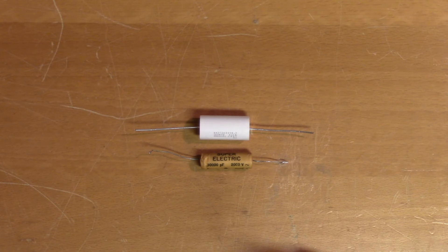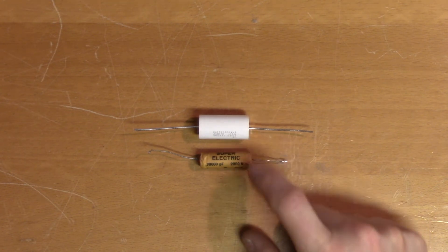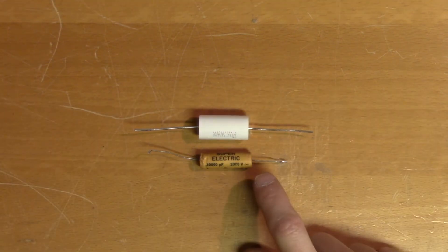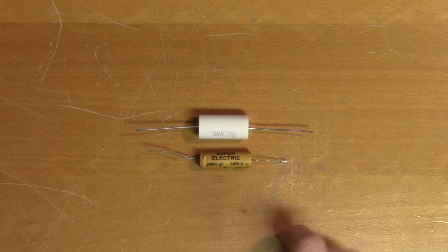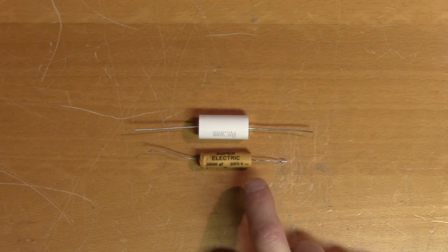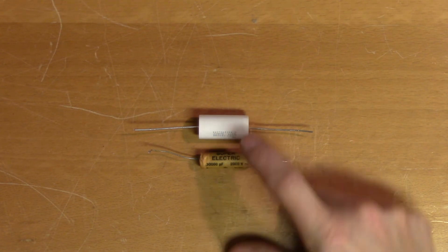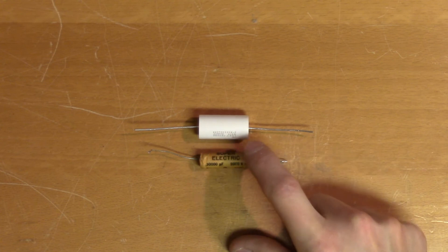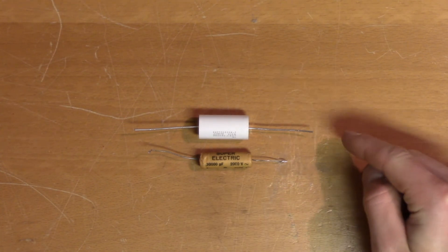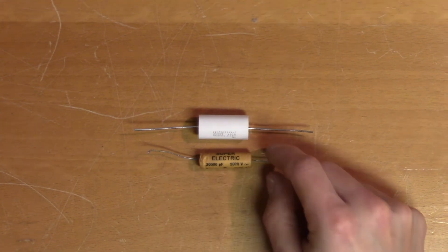So when installed correctly the old wax capacitor has far superior interference resilience than the modern film capacitor. Now what I'm curious about is how they managed to make a paper-based capacitor that can handle 2000 volts, yet is much smaller than a modern plastic-based film capacitor with the same ratings, and that while still maintaining a solid metalized outer foil. And if that wasn't enough — if I'm interpreting this voltage rating correctly, this is for AC, which means this could actually handle a peak voltage closer to 3000 volts, as compared to the modern one that is only rated for 2000 volts DC. Now it is a bit disappointing to replace these capacitors with components that will certainly perform worse than the original. But for now these paper capacitors do have to be replaced, because they are degrading with time.